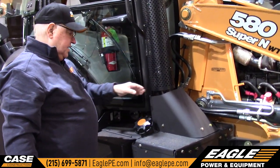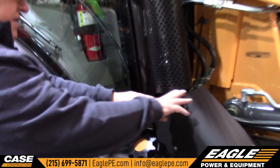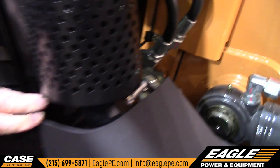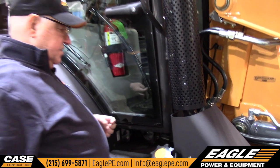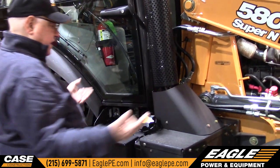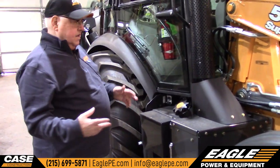I like to point this area out — there is an O2 sensor down here. You hate to see people dump rocks down in here and hit this O2 sensor. It is for emissions; you need it, you can't run it without it. So just be careful enough not to hit that.